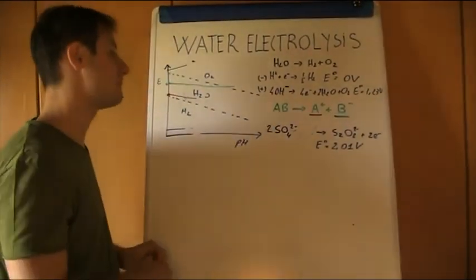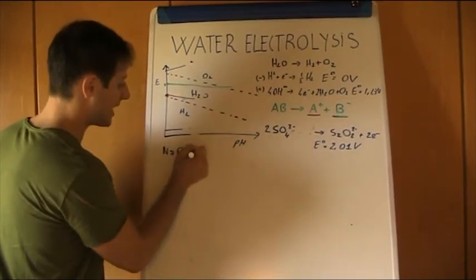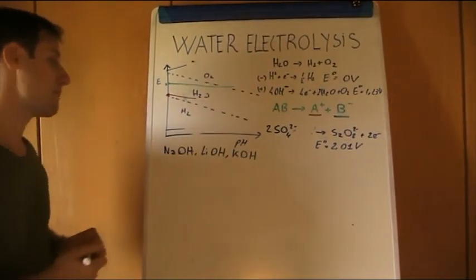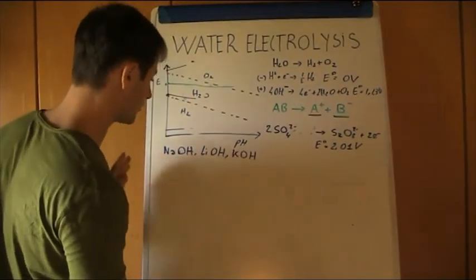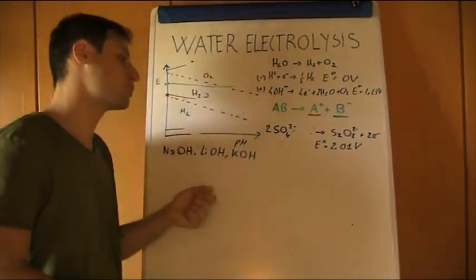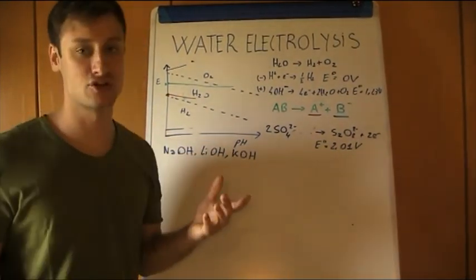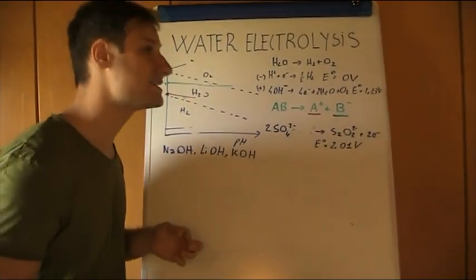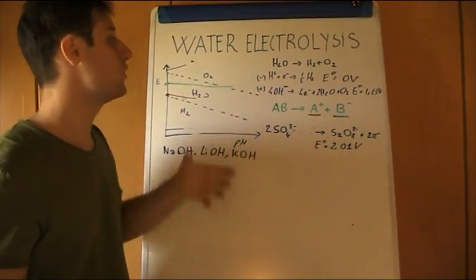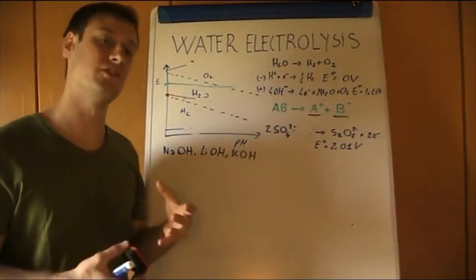We can even use some, for instance, alkaline species, something like this, as electrolyte, but often these types of alkaline species are not used a lot, since it is often better to work in acid conditions, because it's true that working in acid conditions means to use more noble material like platinum as electrode, because we need to resist corrosion. But it's also true that if you're using, for instance, alkaline electrolyte together with hydrogen, we are producing close to this electrode the presence of some alkaline fogs that are difficult to be removed.